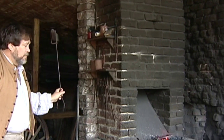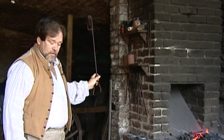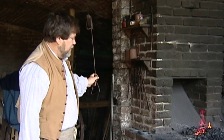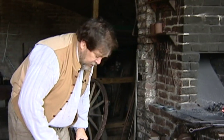I'm also going to show you what different parts of the anvil are for. We've got two shaped horns — a cone-shaped horn and a square horn. The cone-shaped one is for bending circles; the square side is for bending squares. So each part of an anvil is a usable tool. Knowing how to use those tools makes your job much simpler.